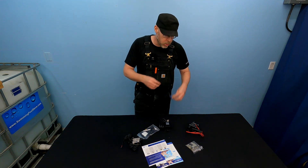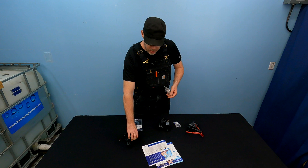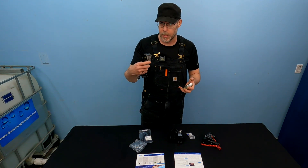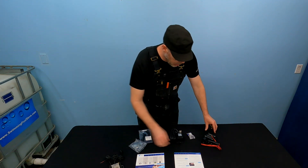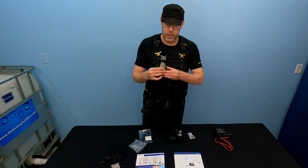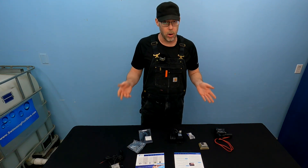Here's the antenna clearly — looks to be about six feet long. So we have two different components. You've got the valve controller, and you've got the part that goes into the skimmer that measures the water level. The valve controller would be mounted with the two wood screws provided, and that's the thing which tells the solenoid whether it should open or close and add water or not. This smaller unit is the one you'd use the two-part epoxy on — it goes into the skimmer and every 30 minutes checks the water level and tells the solenoid and controller whether it should be opening or closing.